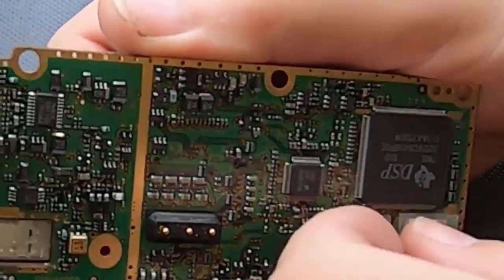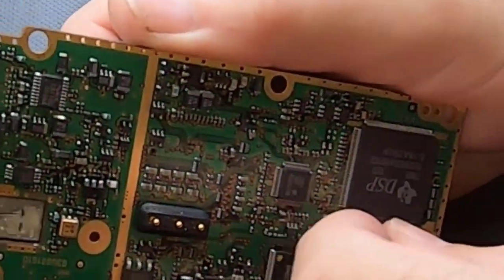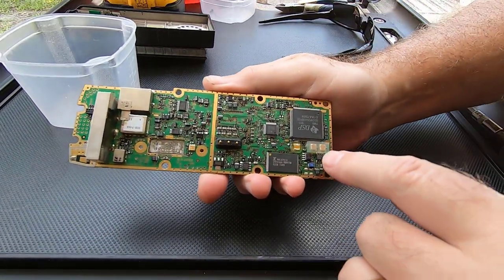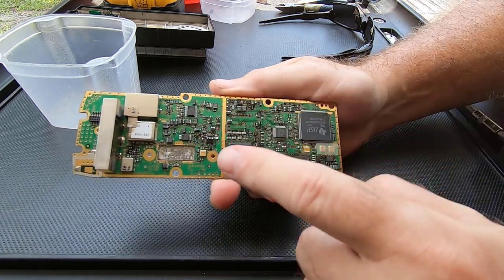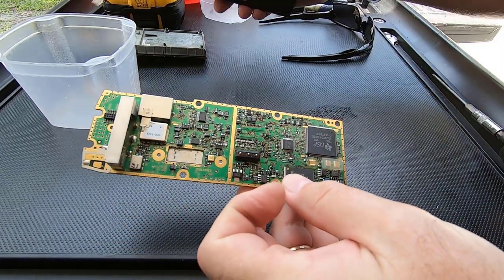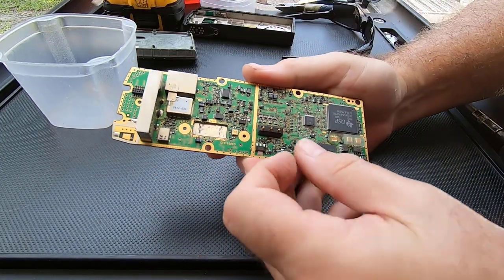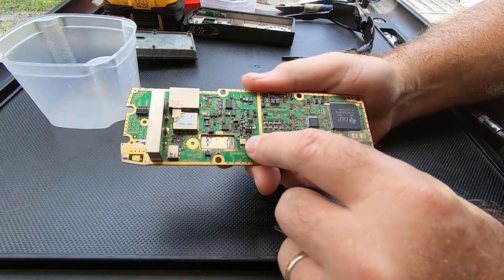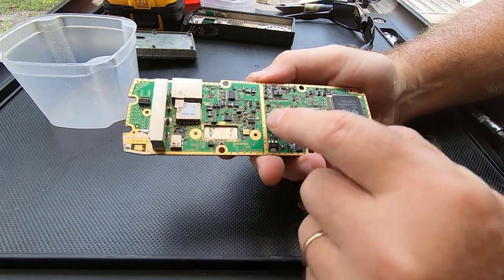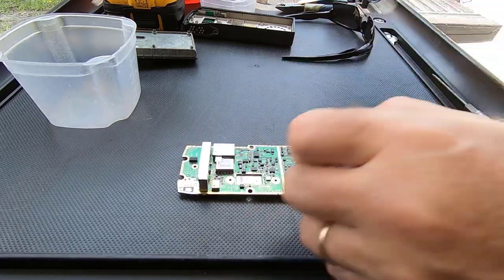Those are some nice big MLCCs — they're all covered with 'gubernus' though, that's the technical term. We'll see if I can get at that. Gold-plate pins again, and given the location on the back of the board, I'm pretty sure these pins were for the battery connection — those are the battery terminals. Gold-edge crystal oscillator, black tantalums or niobiums, more ICs and flat packs. We'll see what's underneath these metal plate covers.